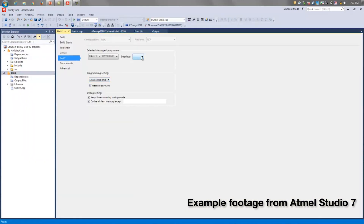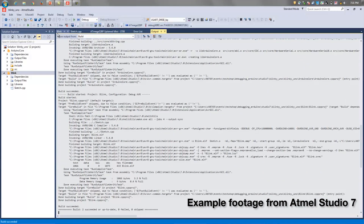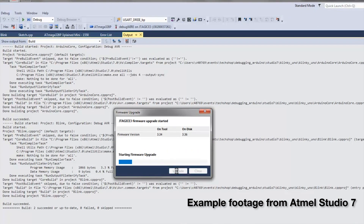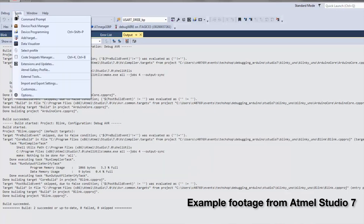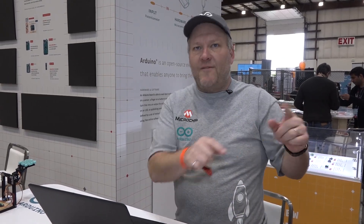With technology from Microchip using Atmel Studio 7, we can take sketches and import them directly into Atmel Studio 7, and through a variety of our debug tools give you source-level debugging including register access, code size optimization, and setting breakpoints. Also, when you bring that into a more professional debug environment, you have the ability to navigate code quickly and actually go physically inspect the Arduino runtime library.